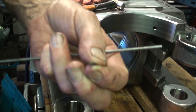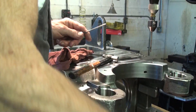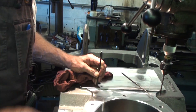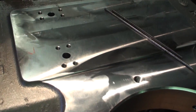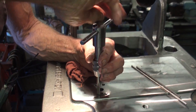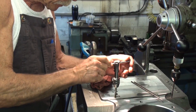There's one more piece. I've got a little bit left in this hole — we'll take the larger end chisel. Blow it out one more time. Then, just to ensure that the hole is clean, I'll grab a tap and chase the thread. Now that we have all the tap out of there and the hole is clean of all debris, we will put a new tap in there to the point where that tap broke, ensuring that all the tap is out and the threads are clean.